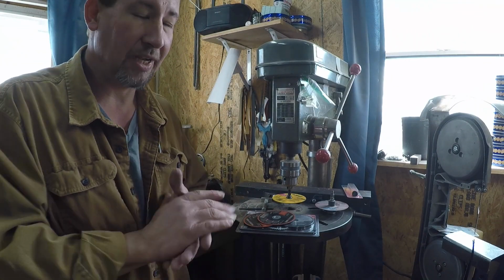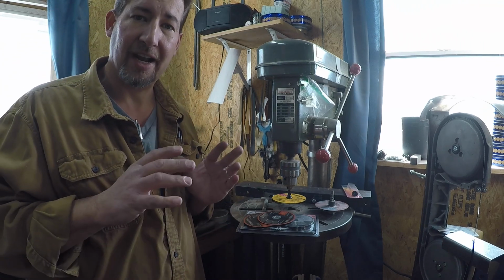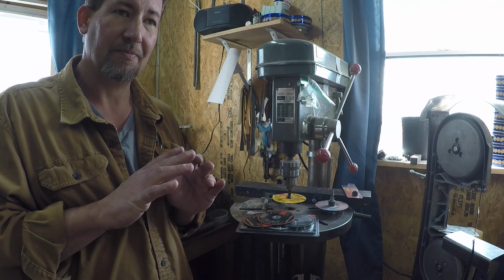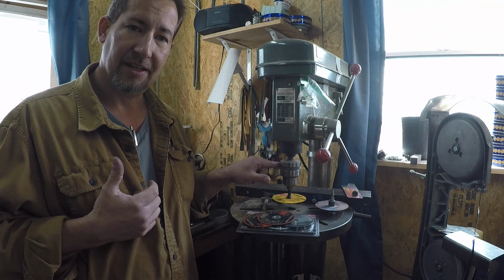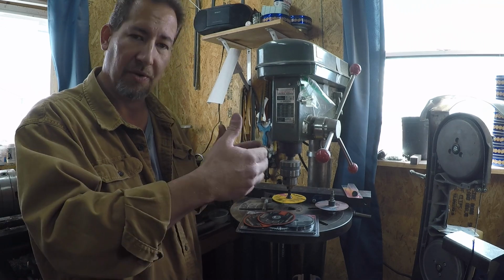Okay, so first, with nail nicks, boy, I've had a heck of a time figuring out a nice way to cut them, which I'm sure an awful lot of other knife makers have also. I tried the 60-degree cutter in the mill or in a drill press, with a vise, where you make up a way to hold the thing. And honestly, those mill cutters have got to cut the nail nick in before heat treat, which really poses some problems, especially as a kind of a beginning pocket knife maker.